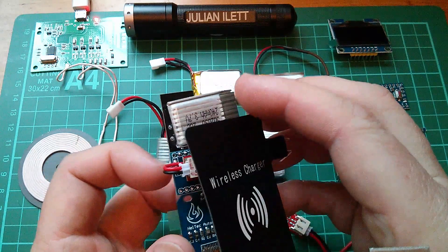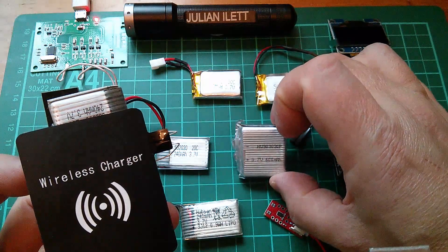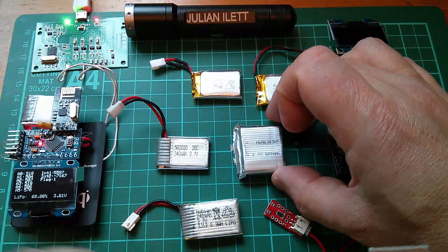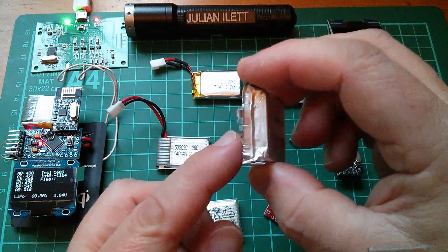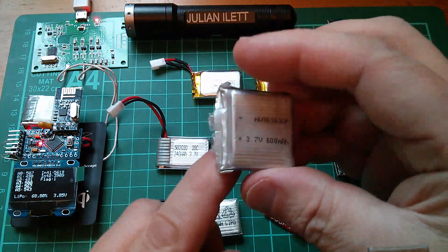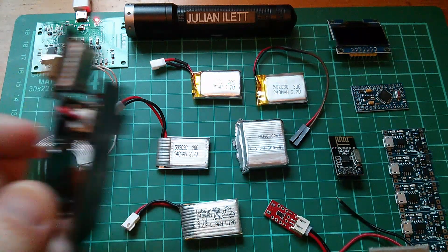You may have noticed I've gone back to an older LiPo. I did have a 600 milliamp hour LiPo in there for a while, but the little tabs were flexing and the positive tab was flexing right up next to the edge of the pack. Eventually it broke through, so unfortunately I can't use that one anymore - but it highlighted a bit of an issue.